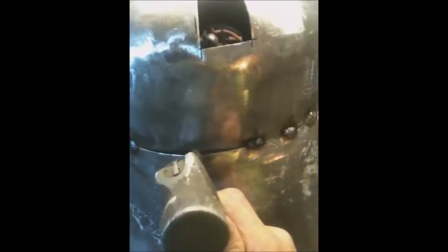Right, that's it, just going to carry on. I can't just bash that in, it won't work. Well, my experience, it doesn't work. I've got to force that in a little bit there, put a tack in, bash that in, more, another tack there, and work my way all the way around, and then I'll seam weld it. So that goes. Okay, I've got it where I like it.